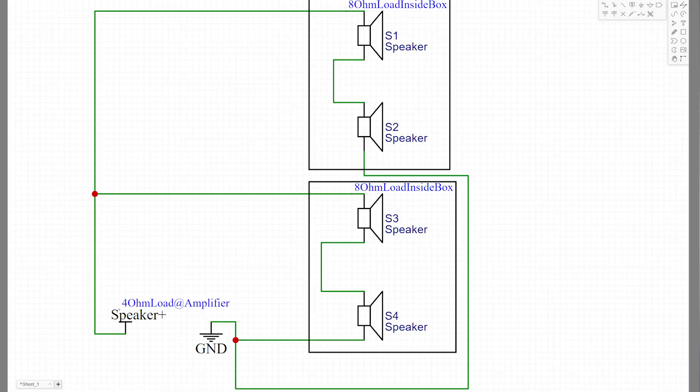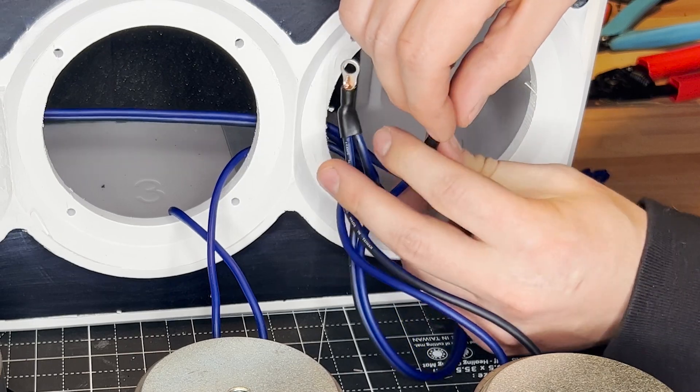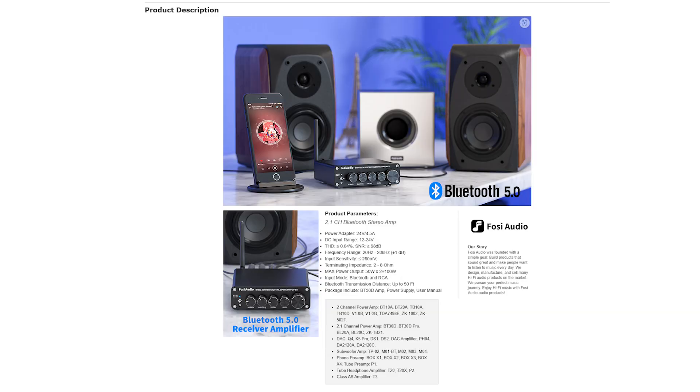It also matches the theme of the line array, which was a bunch of speakers in a vertical pattern. Unfortunately this subwoofer has to lay horizontally underneath the desk, but it gives the same feel of speakers in a line. The speakers are wired in series-parallel — two sets wired in series, then those two sets wired in parallel — fed through M5 bolts to the outside of the box, which runs to the 2.1 amplifier for the computer speaker system.